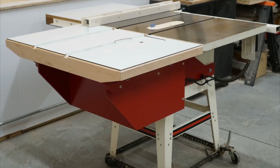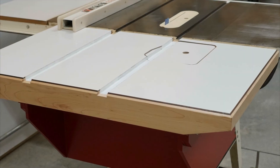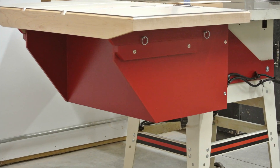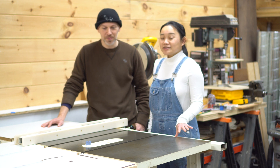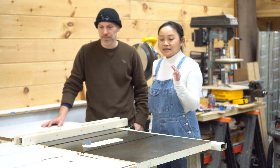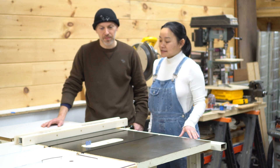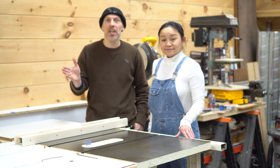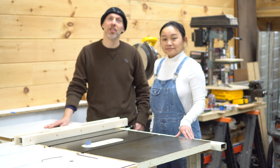This project is now ready for paint and finish. I chose a red paint to match the highlights of my Jet table saw, and added three coats of polyurethane to the maple, sanding with 320 grit sandpaper in between coats. I think this all turned out great. I love how the outfeed table has a maple trim, and it complements the red chassis really well, and this insert is just going to be so safe for us to use. If this project inspired you to increase the functionality or the safety of one of your tools, please let us know in the comments. And until then, we'll see you on our next make.